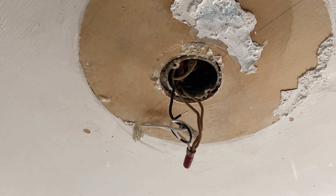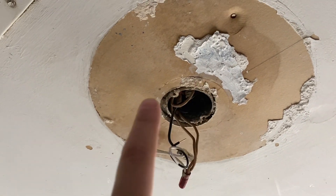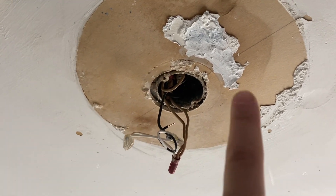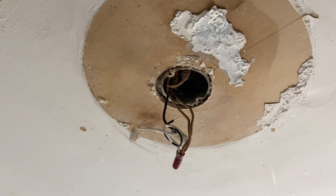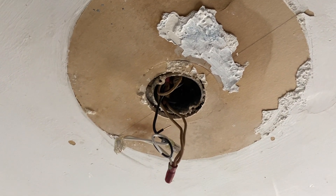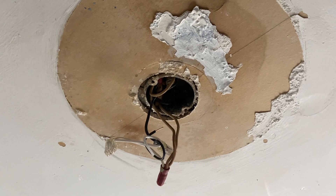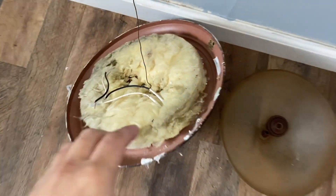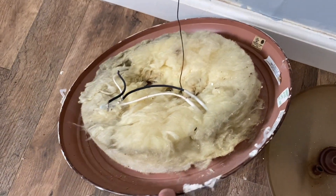I'm going to show you what I'm going to do. This little metal box has to be screwed into something, so there's probably going to be a piece of wood running right here because there's a ceiling joist up there. It's nailed into a 2x4, so I'm going to drill this kit directly into that 2x4.